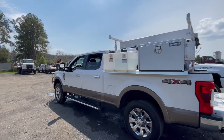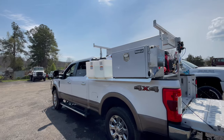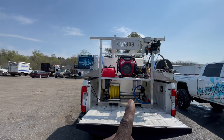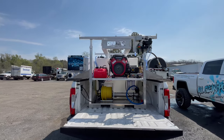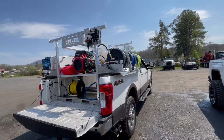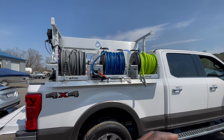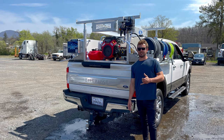Here's our All Clean Pro Plus skid right here — you guys probably know Austin Davis, this is his unit. Same soap, same degreaser tank right there. The white box is going to have your pump and your deep-cycle marine battery in it. At the bottom you have your four-stage water-fed pole system, your surface cleaner racks at the top, your proportioner to do all your chem injection right there, and of course our downstream injector as well. Our skids come with electric hose reels — you've got 200-foot of pressure, 200-foot of soft wash, and 200-foot of Flexzilla 5/8s. You guys can hit up Austin Davis and go check out his website — he goes pretty in-depth on this unit.